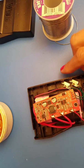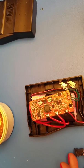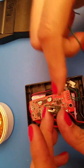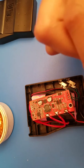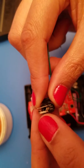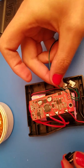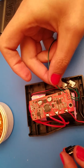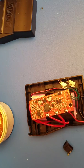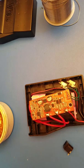The video got cut off, so I'm doing a part two now. What we want is the positive lead from the charge port — looking from the reverse, it's going to be this larger one right here — and you're going to wire that to the voltage in, which is this last one on the right. This one right here, which is ground, is going to go to the ground of your charge board as well. My wire is already tinned up.